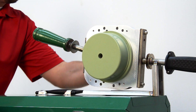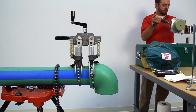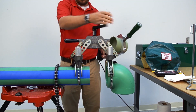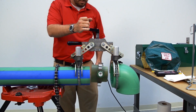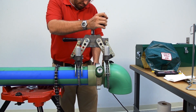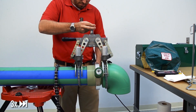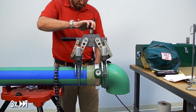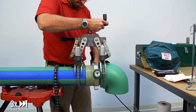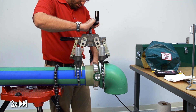This will ensure that we have a clean heater before fusing. With the heater up to temperature and clean, I'm going to insert the heater into the Spyder, onto the pipe end, and inside the fitting. You'll notice I'm bringing the pipe and fitting in touch with the heater — I'm being firm with it, but I'm also letting the heat do the work. Once the material melts a little, it allows a little bit more freedom to crank and bring it together even more. After I work the fitting and pipe all the way onto the heater, you'll see a bead developed right against the heater and the fitting. Once I get to that point, I'll start my timer for one minute as determined by the PPR pipe manufacturer.